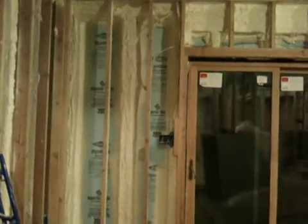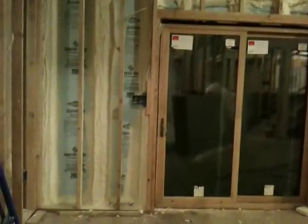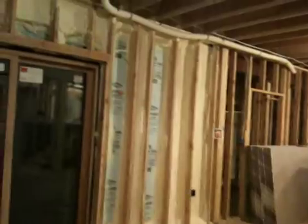We're in the pet room here. That's pretty much what it looks like all the way around — quite an effort today, very labor-intensive. The way the chimney effect works here, you get negative pressure down in the basement. Cold air is being pulled up by the rising warmer air. If there are leaks, that creates growing positive pressure on the second floor as it rises out. The main floor is basically neutral, but the basement is the source of cold air being pulled in from below. By closing and choking all of this off, we hope to go a long way toward isolating and eliminating that effect, in addition to everything else we've done.